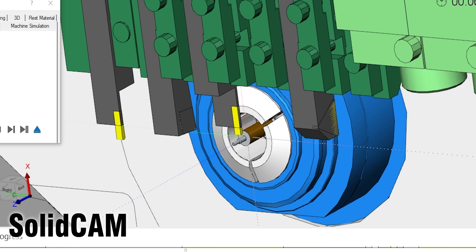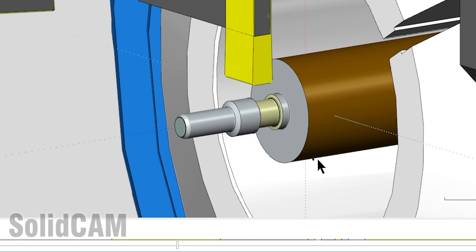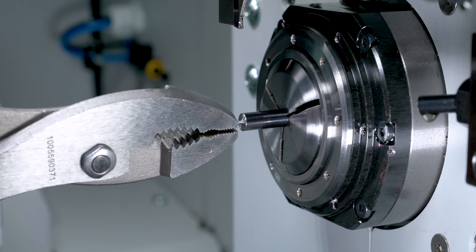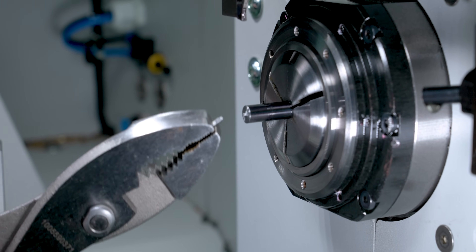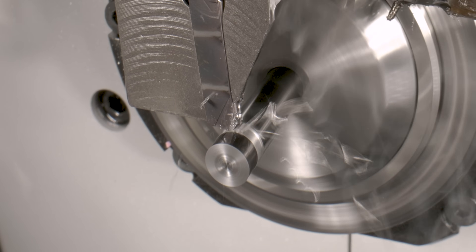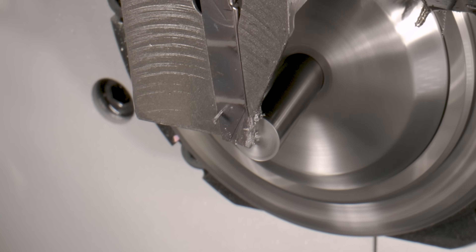When we look in SolidCAM, you can see the part is this tiny little tab sticking off the end of the material, and that looks weak. But you can actually see when I push on the part, it's way more rigid than you would think. If the bar was one-eighth in diameter, I would be able to bend and ruin it. The most important operation we're going to need rigidity for is the initial cutoff when we start our Swiss machine up — as you can see from the footage here, if that bar was half the size it is, it would easily bend during the cutoff process.